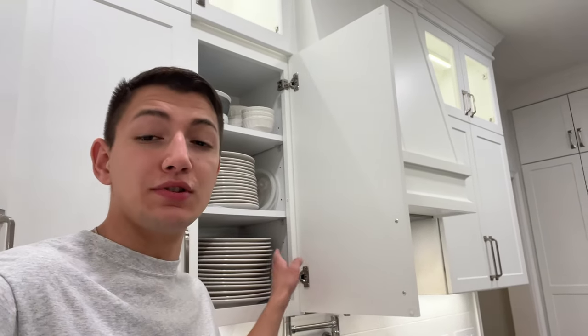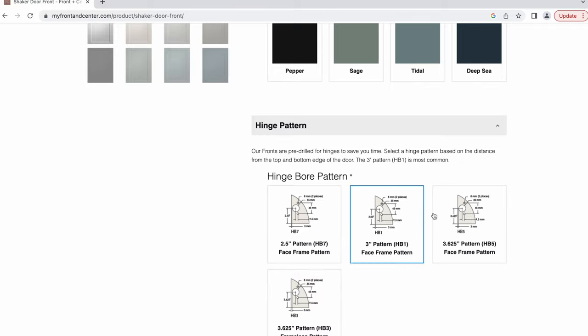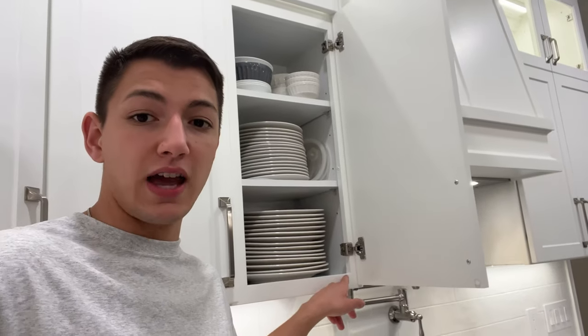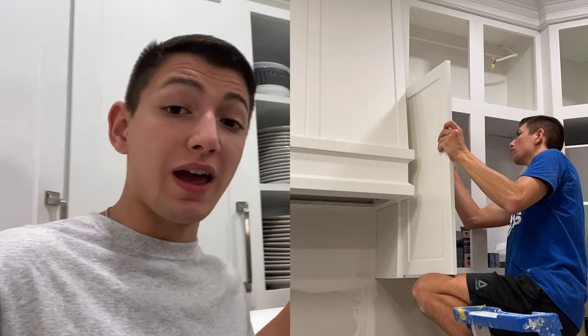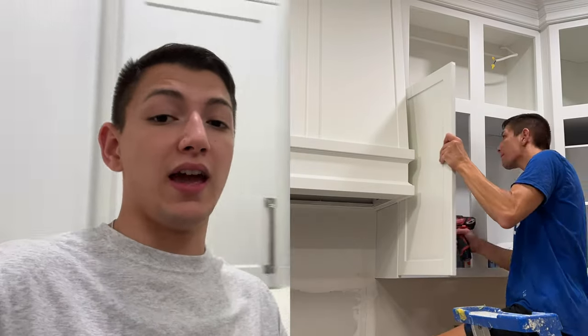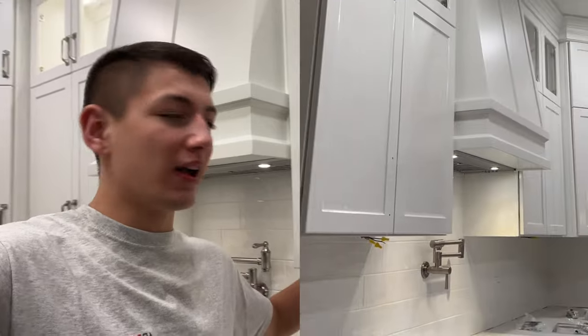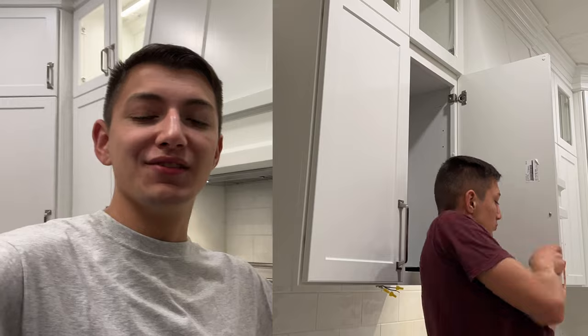Once you have your hinges on your door, pre-drill to attach them to the frame. Take your hinge pattern — you get to decide how far apart your hinges are when you order — then subtract the overlay, which is how much your cabinet door overlaps onto the frame, and that gives you the measurement you need. Line everything up along there. Last but not least, install your new cabinet hardware. I bought a jig off Amazon for this — I'll link it in the storefront below — and it made life a lot easier, letting me continually drill holes for all the cabinets so everything lines up perfectly.